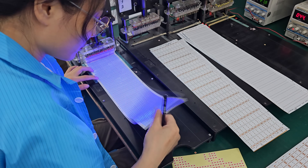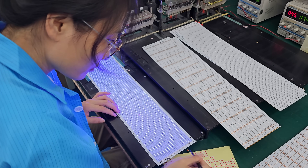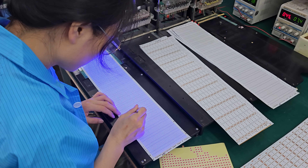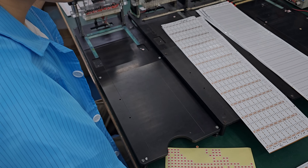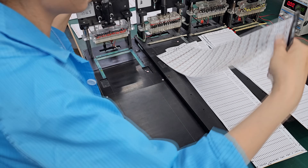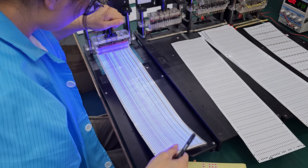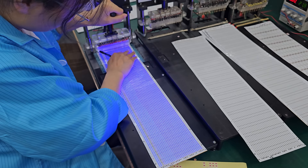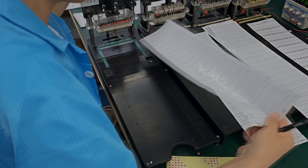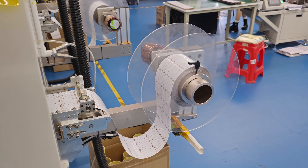Here you can see a close-up of those tiny tiny little light-emitting diodes — there are thousands of them on this little circle. After they've been placed on these half-meter sections, they check each section to see if everything went right. Again, this is for the single-color blue version which can then with phosphor become a white LED strip. They have these jigs which clamp in the LED strips all at the same time, and she has to slap it around a little bit to make sure all the connections are okay.